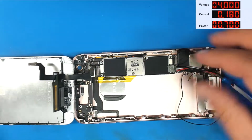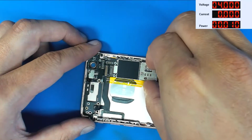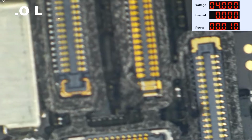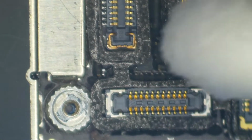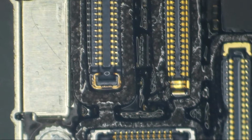So this is absolutely a no backlight phone. It is also absolutely going to be, very likely, something going on under the CPU shield. So let's go ahead and take the board out of it. And I'm going to go ahead and add some alcohol to these sticker pad things here because they're going to get severely destroyed whenever we heat this up to remove the shield.